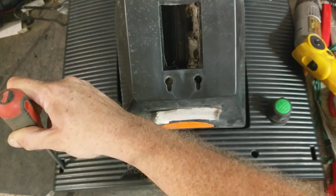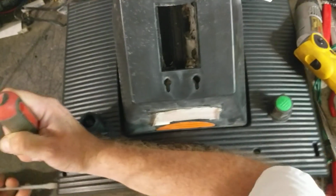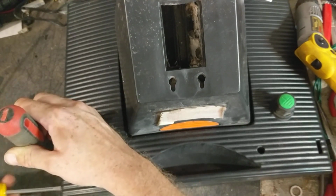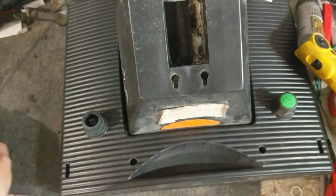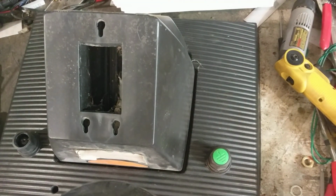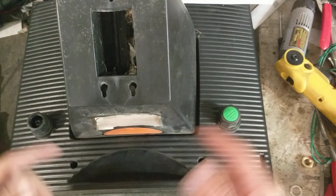And it goes in the corner here, on the side of it, whatever works. Don't gouge it up too much. Just work it past there, and it's like the thickness of the screwdriver. Spread it apart. Once you get both sides popped open, lift it up, stand the unit up, and watch for these screws that are right here to fall out onto your table.